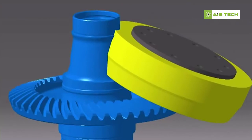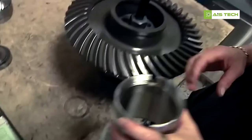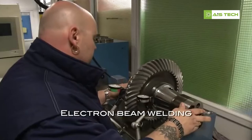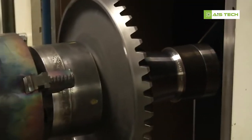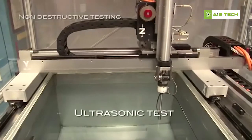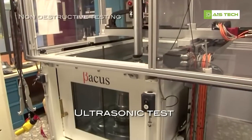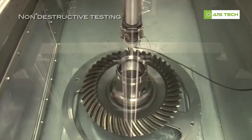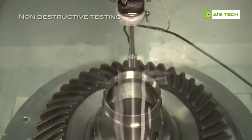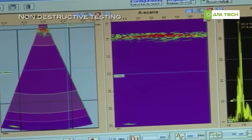Machining limitations require that all shaft bevel gears be made in two parts. The gear and vertical shafts are assembled by electron beam welding. This process is computer monitored, and a fine focus control allows accurate positioning of the weld. The quality of the weld is checked by ultrasonic and radiographic methods. These measures assure a solid, high-quality, reinforced weld.